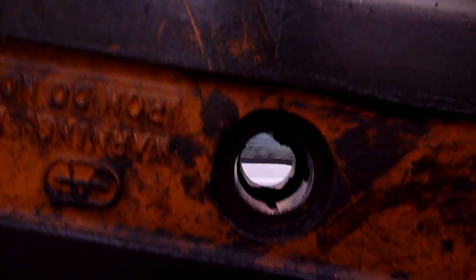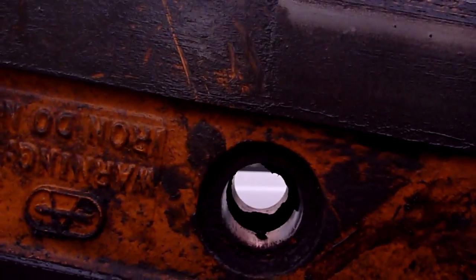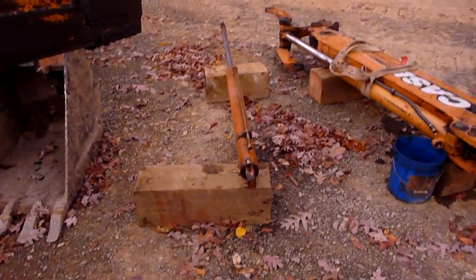I'm not sure on my L, it's probably the same way. Then you just take a snap ring off there and slide that pin out, and that releases the pin out of the hydraulic cylinder. Your hoses for that cylinder connect right there.